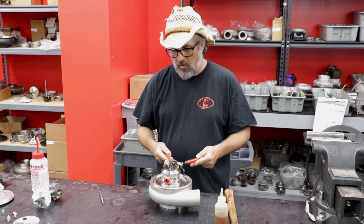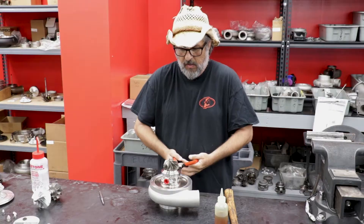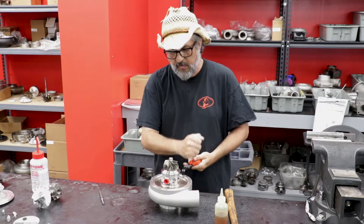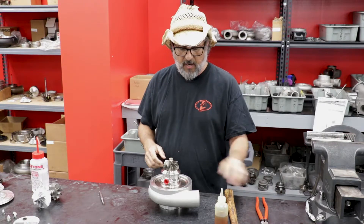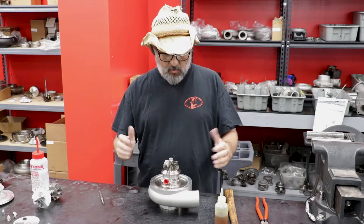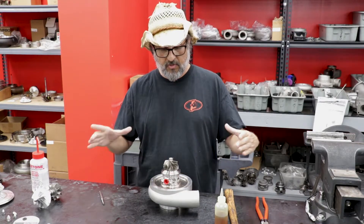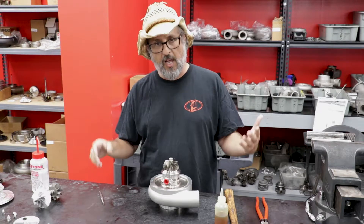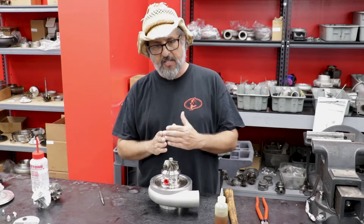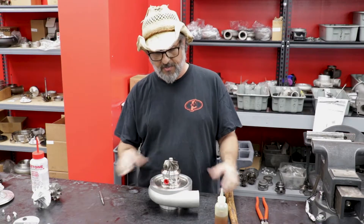Line up on the holes, compress the snap ring into the groove, and tap the tabs down so it snaps into the groove. A lot of times you think that's the end of it, but it's only kind of in there — the spring force has set the snap ring into the groove but it's not all the way in. You want to set the snap ring all the way into the groove once you've determined the final orientation of the cartridge.